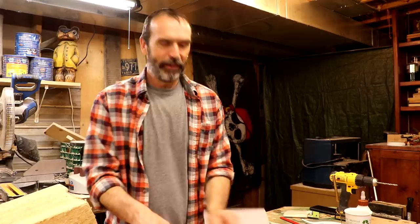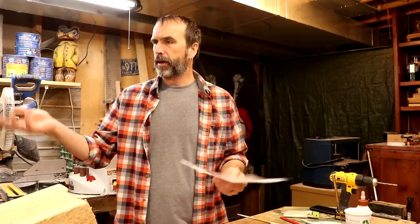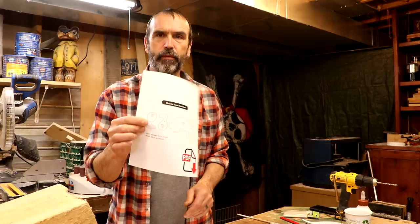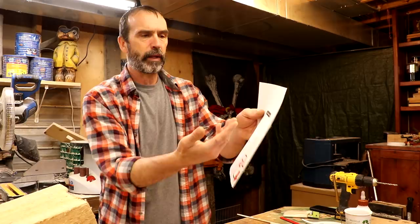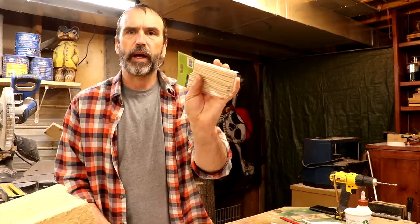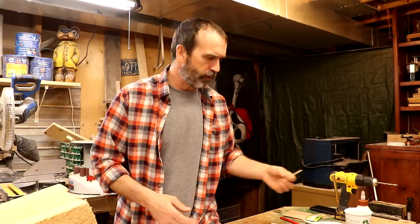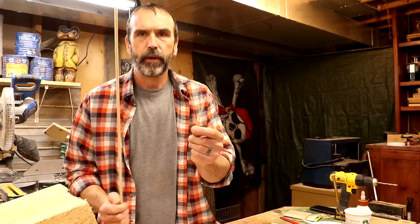I can't not make a video of the little tiny bunny. You can make this out of three-eighths to three-quarter plywood. I use pine - this is just a pine board. If you make the bunny three-quarter, you can make the legs half-inch. But you need a quarter-inch dowel or close to it, and eighth-inch dowels or close to it. I say 'close to it' because I don't think these are true eighth-inch dowels from the craft store - they're just little skewer-type sticks.